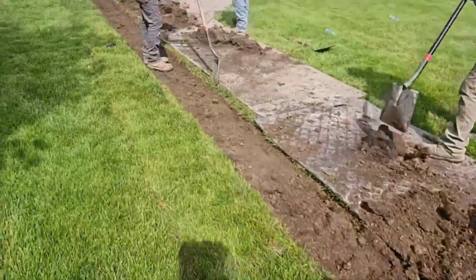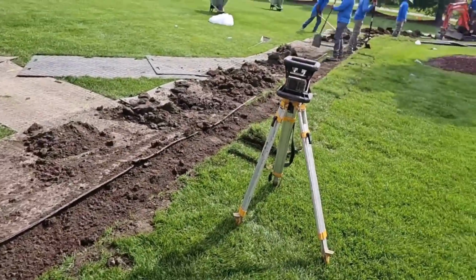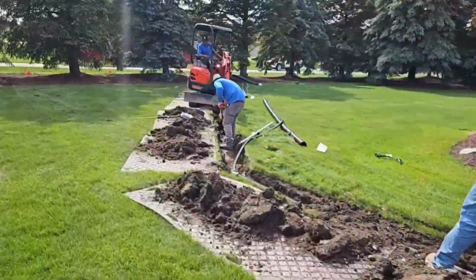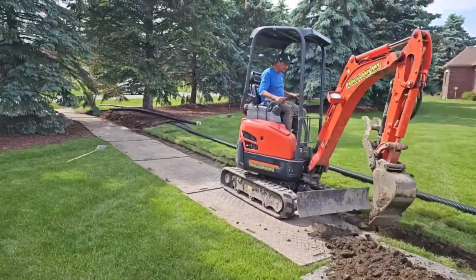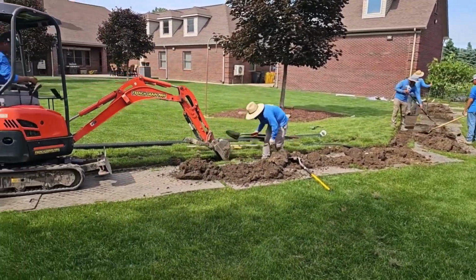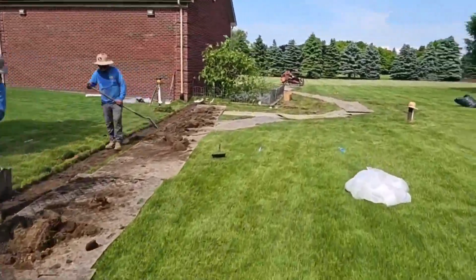We're going to sleeve our discharge line to protect it from aeration, heavy lawnmowers, vehicle traffic. We're going to use a one-piece, 1.5-inch flexible Schedule 40. We're going to start out with a 100-foot roll, and we will have to add about 15 feet to it because this line ended up at about 115 feet total length from the outdoor sump pump pit to the ditch. The last 15 feet will actually be pitched downward towards the ditch. We got 7 foot of chamber so that when our sump pump turns off, whatever's left for water in the line can run back down into the chamber.